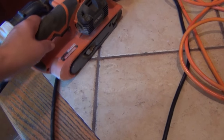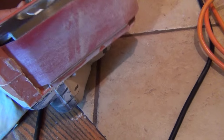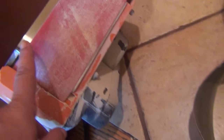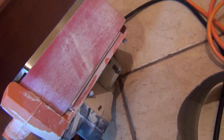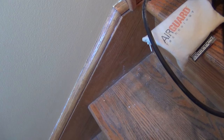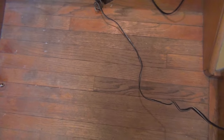I'm starting to sand now because this is really the one thing I don't want to do, but I have to get it out of the way. I have two types of sanding band — the very smooth one and the rough one. I'm going to use the rough one first to get rid of paint stains, the old shellac and all of that. Once that's done and swept, I'll use the fine one, and after that I'll do a hand sand with steel wool to make sure the surface is really nice. I'm not doing the risers since I just don't have the time — I may gently rub them with steel wool to see what the stain looks like on them.